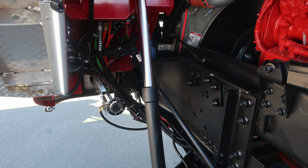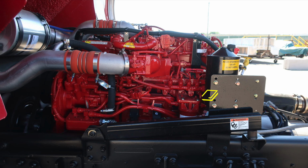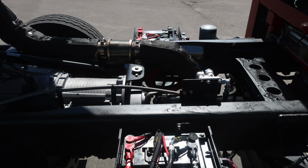When tilting the cab, make sure all obstructions are clear, items secured. Once it's in the full upright position, stow the arm in its secured area to the upright portion of the cab. At this point, do not lower the cab back onto the safety bar. It is purely for safety. You should maintain pressure behind both cylinders.